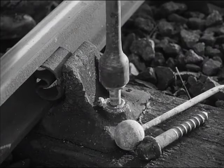Another common fault is the hanging sleeper. Notice the gap between the foot of the rail and the chair, and look for faint rust marks all round the base of the chair. Now watch a train passing over a hanging sleeper. The sleeper is not properly supported in its bed and must be packed with chippings. The amount of chippings is determined by judgment and they must be spread evenly below the sleeper.